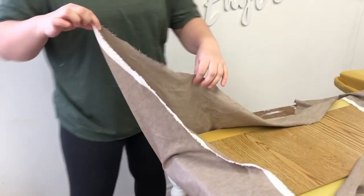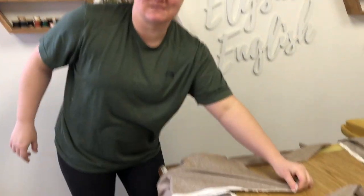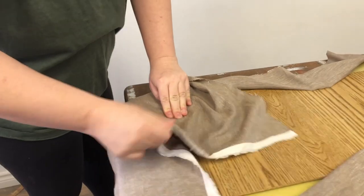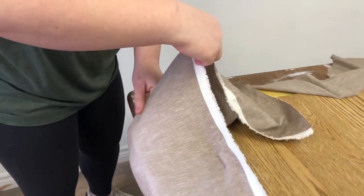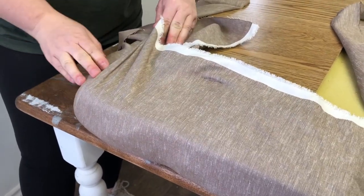What I do is I have a corner point here because my rectangular piece of fabric is what I started with. What I like to do on a squared-up corner — my corner is a little bit rounded so it's slightly different than if I had a perfectly square corner on a rectangular four-inch-thick piece of foam for a bench — but the premise is pretty much the same. So I take the center piece — this is actually quite an excessive amount of fabric here but I want to make sure I had enough. All I'm going to do is pull it a little bit tight and put a staple holding this center in. Then I take this section that I'm left with and I need to make sure that this is super smooth on this side and create some type of a little seam to cover over. Because I'm a rounded corner, not perfectly square, I have to work to make it look really clean and seamless.